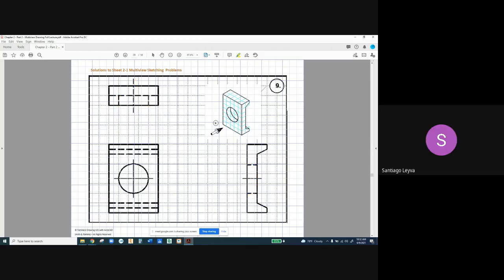So at the moment, we should just assume that all boreholes extend all the way to the back end. And you can see the back of this one — it's clear back there. We don't have another counterbore, but that is the depth right here. So anytime you see a hole and you cannot see the back of it — this one looks like a counterbore, but there's no material there — so that one goes all the way through.